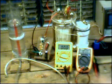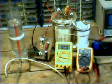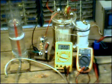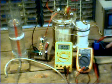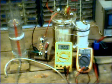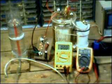You may notice I have a little bit more bench space than I did previously. I reached my clutter saturation level yesterday and spent most of the day completely reorganizing my bench, trying to recapture some bench space on this postage stamp that I call a research lab. What I didn't show you was the AC to DC full-wave bridge and the filter capacitor that is also tied to the top of the cell. I have a 12-volt regulated DC supply, and when I want to supplement that, I can boost the current and voltage at the cell up just a little bit more to change the results of the gas I'm producing.